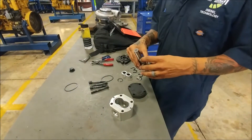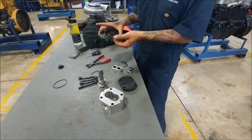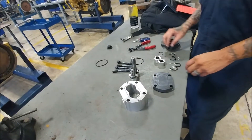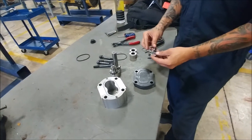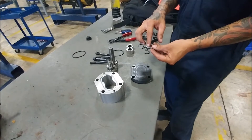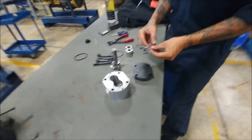There's the other little piece to it. I've got some snap ring pliers here because I had to inspect the oil seal, and I had to use some snap ring pliers to check that out. I got some picks to put that oil seal out and put it back in. These are the various seals. You can see that this one's got a rubber and plastic seal that kind of goes together. This plastic here is a little bit chewed up. That's one thing that you're going to be checking for, because if any of your seals are chewed up or dry rotted you're going to end up having a fluid leak in the pump itself.